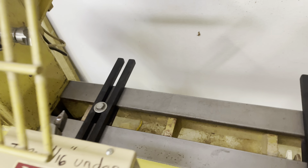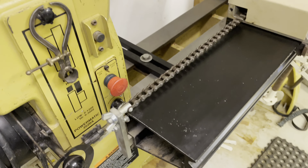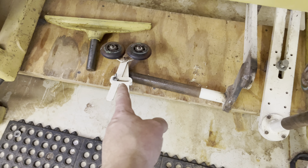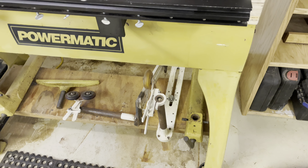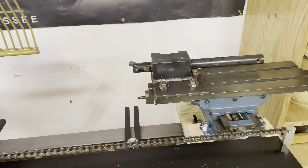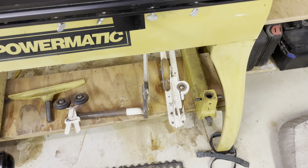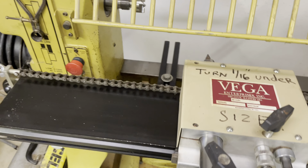I cleaned the ways of the bed as well as the exterior of the lathe and got everything tuned up and ready to go. I've also got auxiliary wheels down here — these are for holding the shell when making cuts with the XY table setup, because on a longer shell you can get chatter which can wreak havoc in the turning operation. Since I'm only doing snare drums they probably won't be needed, but they're there if I need them.